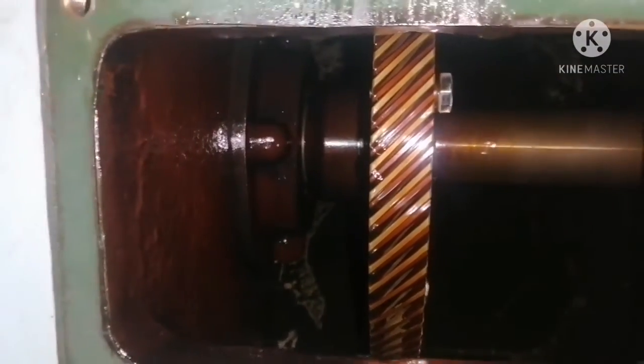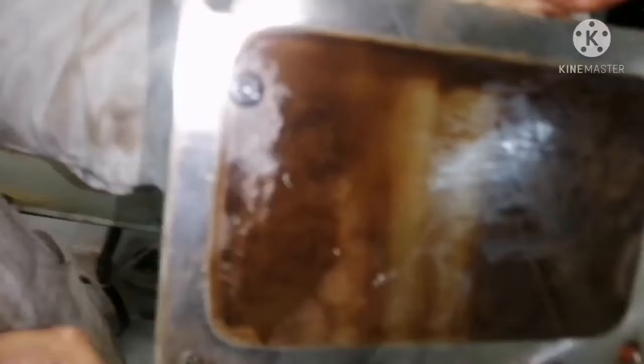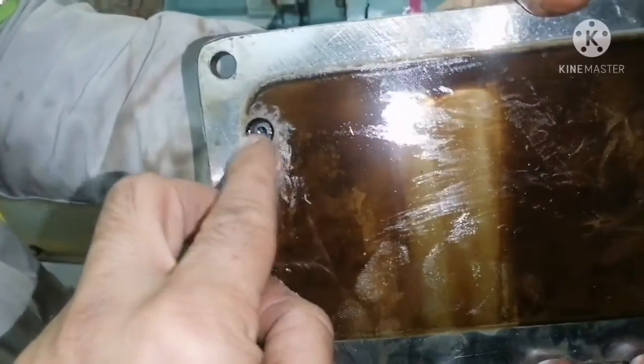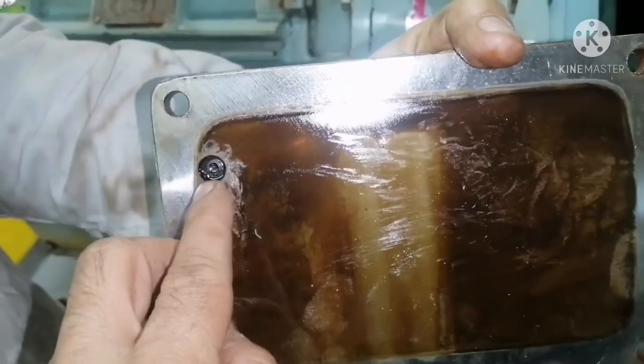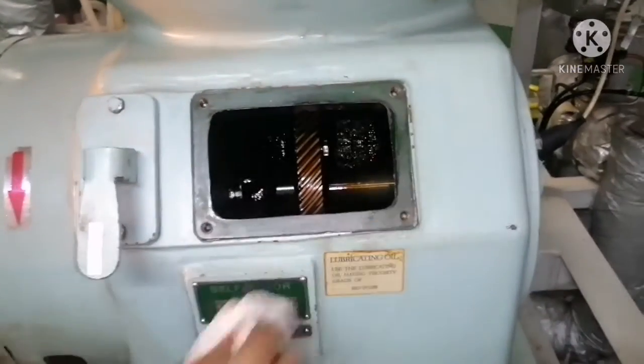You can see the oil inside. This is your gear — vertical shaft and horizontal shaft. The horizontal shaft is visible here, and the vertical shaft is on the other side. You can see the oil inside is due for renewal. You can also see the bearing in the corner — that is your horizontal shaft bearing. This is the inspection cover and this is your vent hole. This hole should not be blocked, as it acts as a vent to avoid over-pressure in your sump.